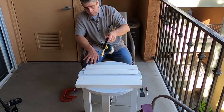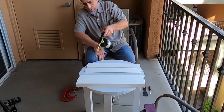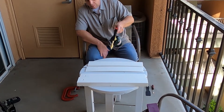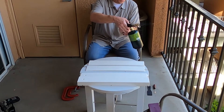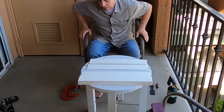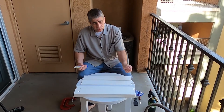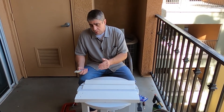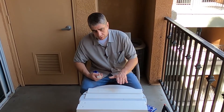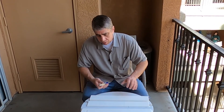I've got a little bit of wind that I'm contending with, so I'm trying to stroke in a consistent fashion. That thin piece definitely arched. I probably had a little too much heat on this thinner piece. There is a test you can do using water to see how successful the heat treatment was — essentially you want to make sure that the water doesn't bead over it, and that the water creates a nice clean sheet over it.